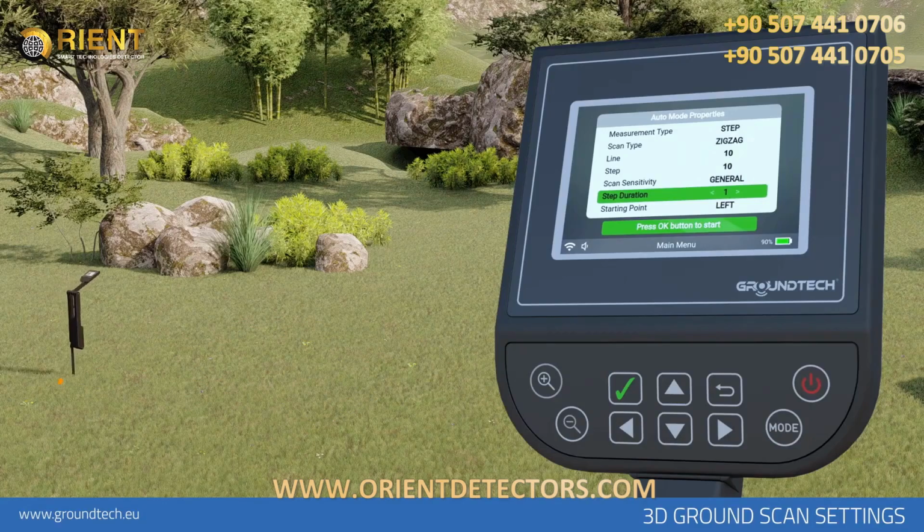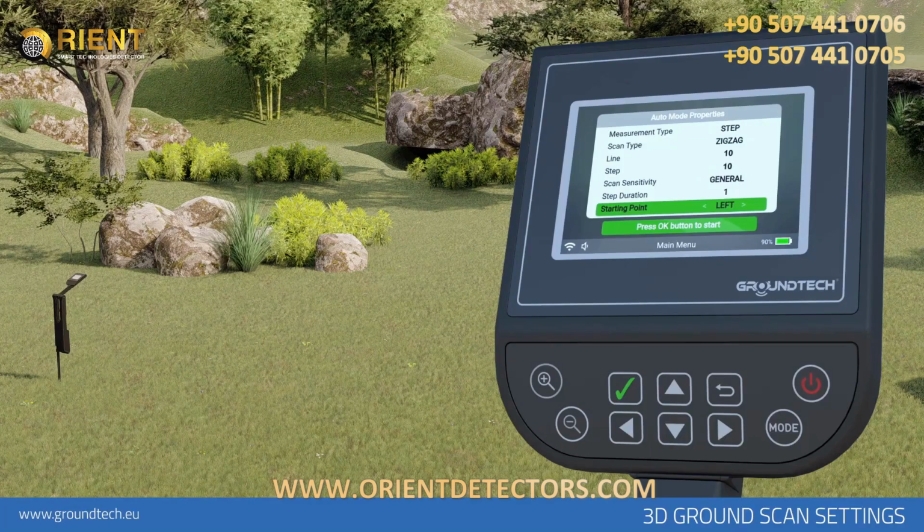Step duration. If you want the device to wait between each signal pulse, you can select not less than 0.8 seconds. When you increase the time, the waiting time will increase. This feature is activated in the automatic search option. Starting point. You can adjust your scanning starting point by starting at the bottom right or bottom left corner. To do this, you must select left or right from the starting point.